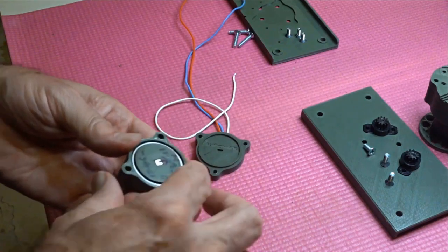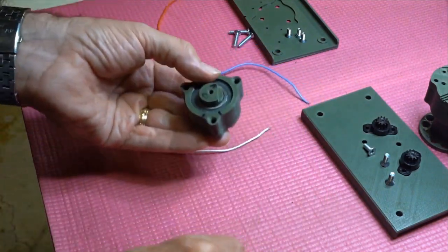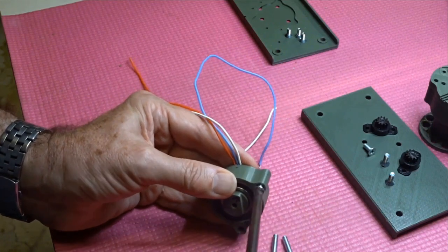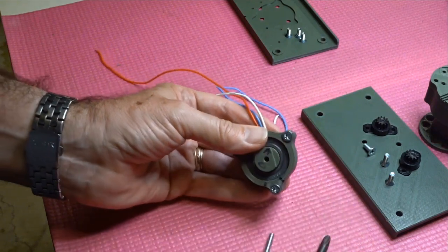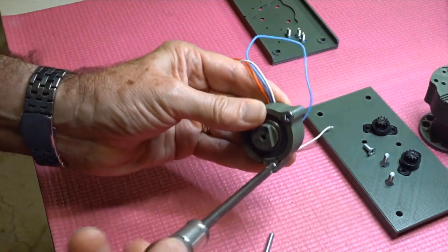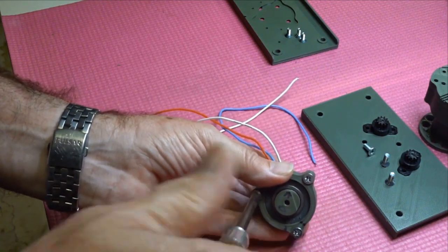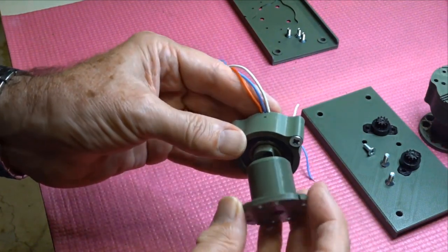So this is pretty standard Maghall assembly. Just make sure you use the one I gave you with the files, because there are a range of Maghall designs. Okay, so 20mm bolts again, same as the upper. Now, assuming you've aligned your hall sensor correctly when you put it in, your magnet's aligned according to that dimple, so we don't have to sit here aligning this while we assemble it. Do that up. Now, this can only really fit one way at this point. So that goes in there. Another 14mm countersunk screw.